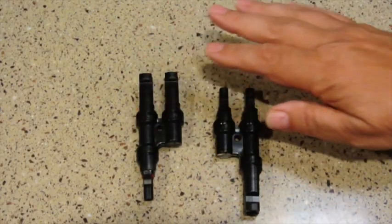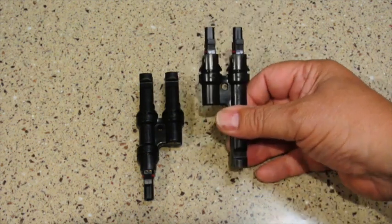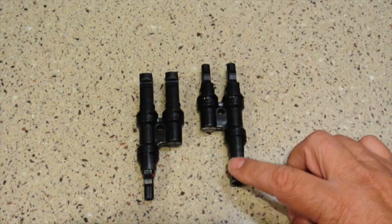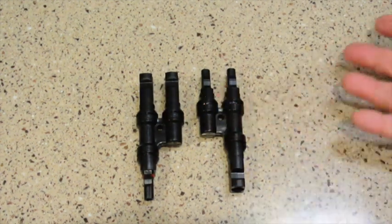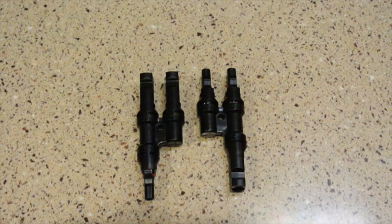The easiest way to parallel panels is to use these adapters, which are parallel connectors. These are one-to-two versions — one connector on one end and two on the other. The single end goes to the charge controller and you can get these in two, three, or four panel versions. When connecting panels in series you don't need any adapters — just plug the negative of one panel into the positive of the next, and then the remaining negative and positive wires go to the charge controller.